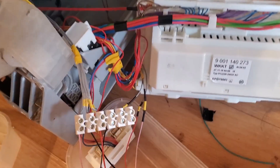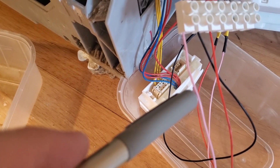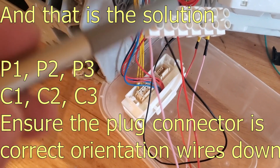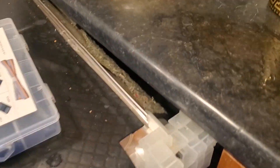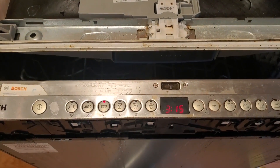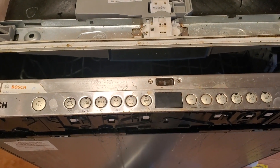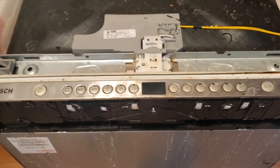So we're trying this connection. Here we've got P3 on the left going to the pink, which is C3, controller 3. We've got the 2 to the 2, which is the black. And then we've got the 1 going to the red, which is controller 1. So let's power this in and see if it does anything — it might go pop. Oh, there's a noise. Let's try and power it on. There's a number. I'll put it on that one. I'll shut the door.